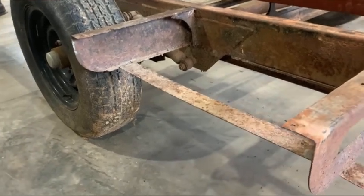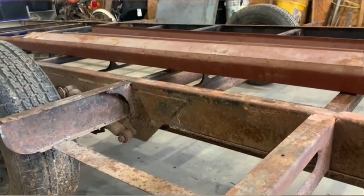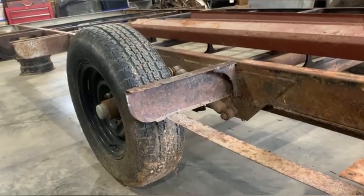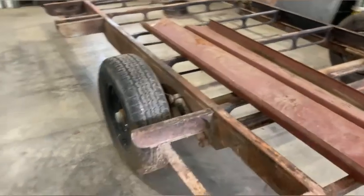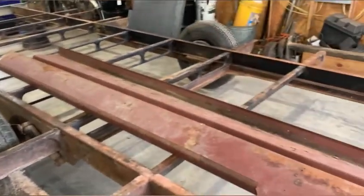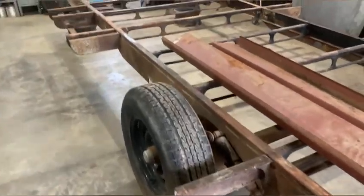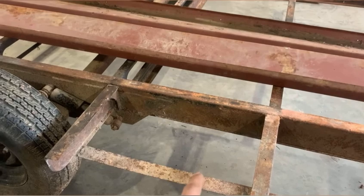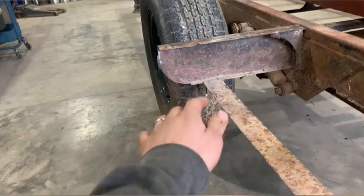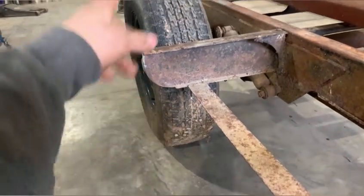The PVC board is three-quarter inch black plastic - pretty high density, pretty strong, but it probably flexes just a little bit more than regular plywood. That's part of the reason I'm adding some of the structure, although as it sits I don't think you'd need it, but I do overkill on everything. So we're going to add angle iron - basically a strip of angle iron from here to there - and when the shell sits on it everything will be tight. I'll put a bolt probably in the middle and one on each end, same all the way around.